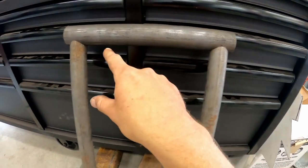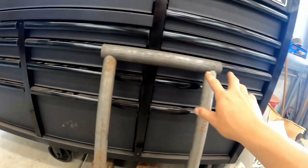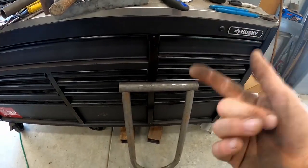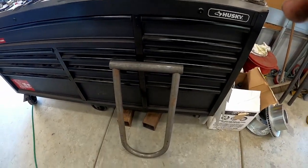Got some nice 90 degree corners so I know it's straight. All we've got to do now is make the collars out of the inch and three quarters, weld some plate onto them, and we'll be able to clamp the lower die and the planishing hammer in. Let's get it done.